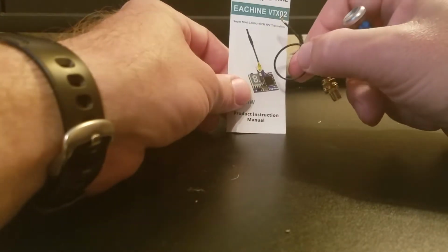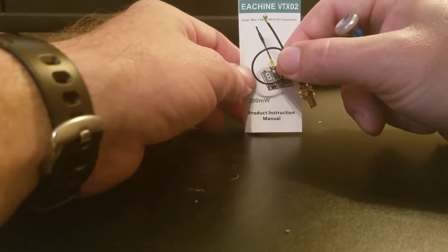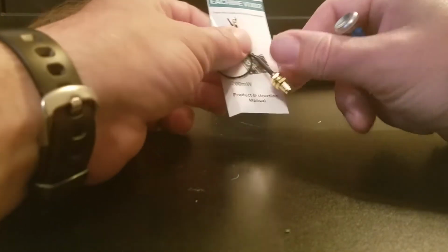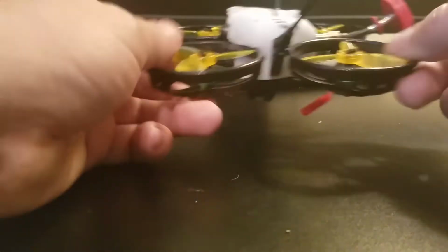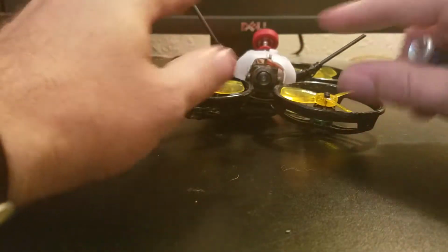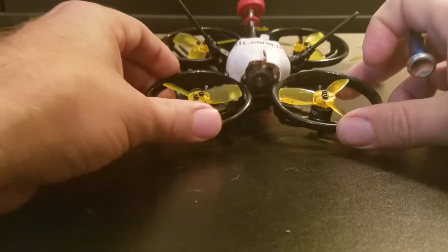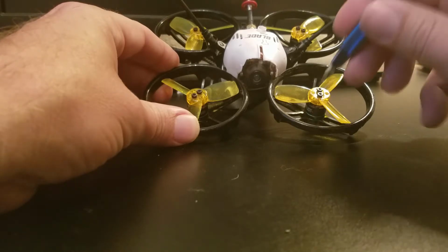But like I said, I fly solo, so I don't have to really worry about changing my channels. I set mine to 5740. I have it running 200 milliwatt, and that's what I fly. So once it was fixed in there, I just glued everything so where it wouldn't come out, and that's what I run. And I like the option to run my own antenna. Anyway, I know that was pretty quick, but I didn't want to waste a lot of time. Just kind of give you an idea of what I used, what worked, what didn't work, and all in all, I like this setup.